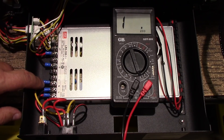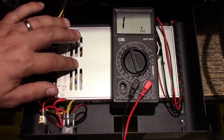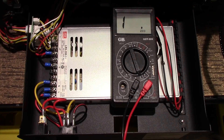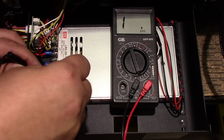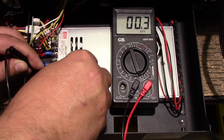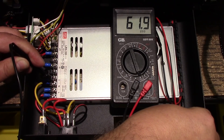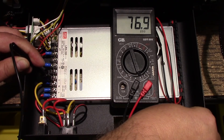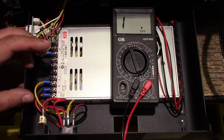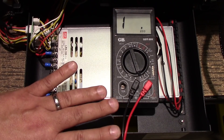I've noticed this on my CR-10 as well — the configuration depends on the mechanical connection of this case to the powder-coated metal case to create the ground. If I touch the case directly, I've got almost a dead short — 0.3 Ohms. But if I touch the outer surface, I'm getting somewhere around 60 Ohms, and it varies. This is because the powder coating is acting as a bit of an insulator — I don't have a very good mechanical connection between this case and the printer's case.